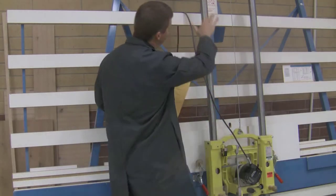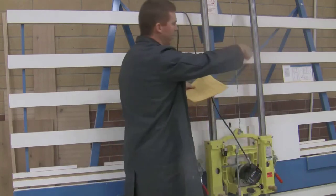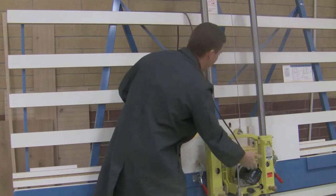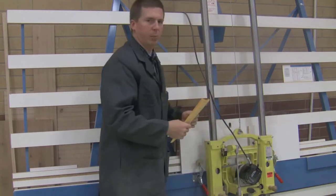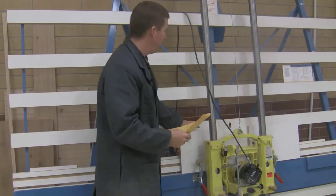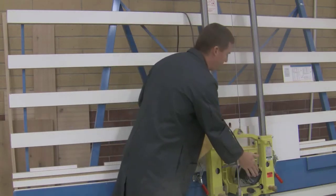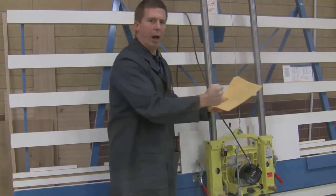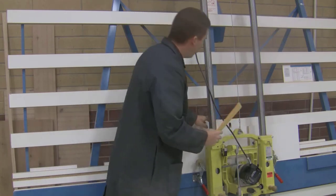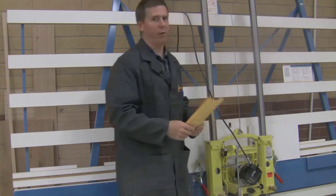When you're done cutting, put the router all the way down to the base so that the next person isn't tempted to cut downward — make sure it's down so they're ready to cut upward for their next project. The panel router saves us a lot of time, especially if you've got large pieces of wood that need dados cut in them. That way we're not trying to freehand it with a handheld router or a table saw, which can be clumsy. The panel router saves you a lot of time and gives you a nice, clean, straight dado every cut.